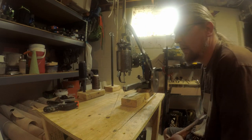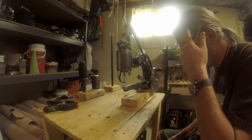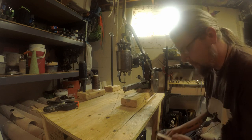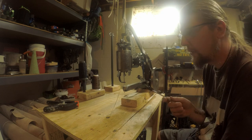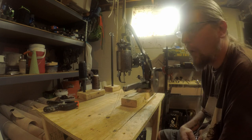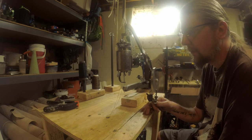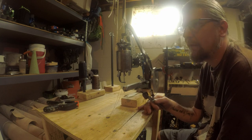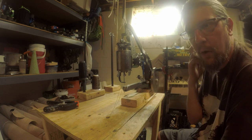So I'm going to show you the shoe patcher — I made a stand for this. I started this video like a month or so ago and I've just been busy doing other stuff so I figured I'd finish it up. It's tuned up pretty well. I got it all greased up and I ended up taking the presser foot off and grinding the feet all the way down. Then I took my jimping file to it. It still leaves a few little marks. I've got the presser foot tension as low as I can go before the nut will fall off.